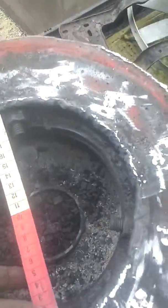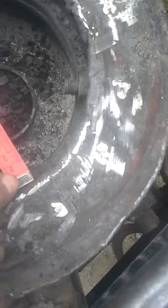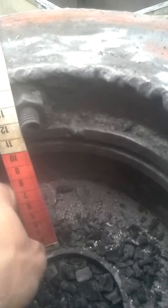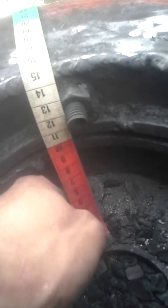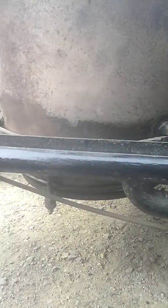This is an 8-inch or 20-centimeter fire tube. Height to the restriction is about 12 centimeters from the top nozzle and 9 centimeters from the bottom nozzles. The restriction ends here, and this whole compartment is just filled with charcoal.